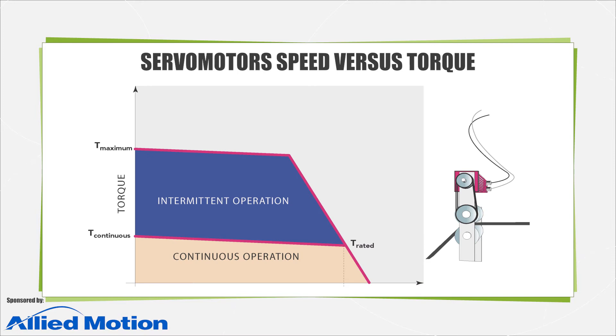Note that manufacturers classify motors for constant speed tasks by horsepower or torque at base speed. In contrast, servo motors operate over speed ranges, so aren't rated this way. Instead they have speed-torque curves that express continuous torque capabilities that won't threaten to overheat the motor, and intermittent or peak torque for acceleration.